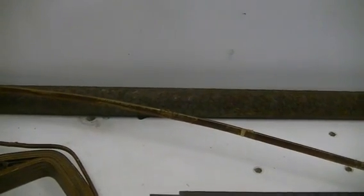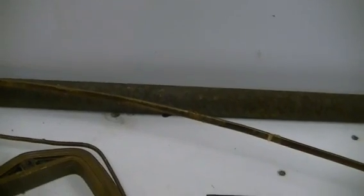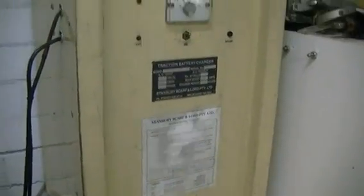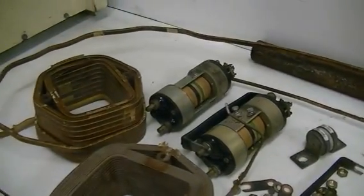I have to clean up some of the solid shaft in the lathe, take it to work and put it in the bender, because my bender will not bend inch-and-a-half solid shaft. We'll get that all done and made in the next video and put all this together. I'll get the rest of the battery bank in — we've got some fairly heavy cable that should handle a thousand amps at a quick pulse. We'll stick some bits of steel in there and see if we can actually make some decent magnets. This is old school stuff but very reliable, and 30 amps at 48 volts is not a bad battery charger at all. We'll see you next video when we start our build — cheers.